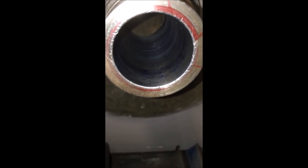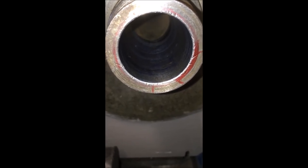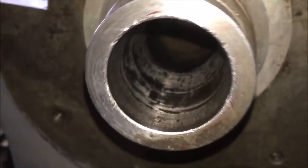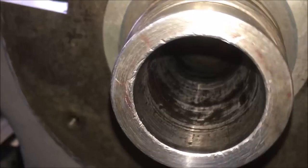So that's the main problem of the ball on the cylinder. You can see that it ain't exactly a precision ground face. So you can see the blue picking up and my taper is beginning to fit a bit better, so I'm going to get it to the stage where I'm happy and then put some lapping compound on and just see if I can take out some of those high spots. Sorry for the shaky hand. I think it's fairly safe to agree that's a significant improvement.